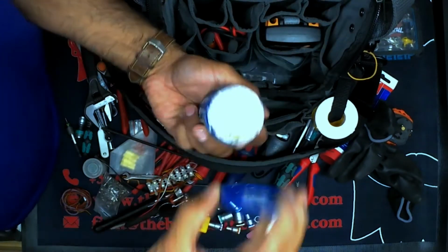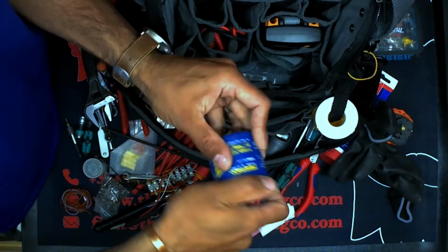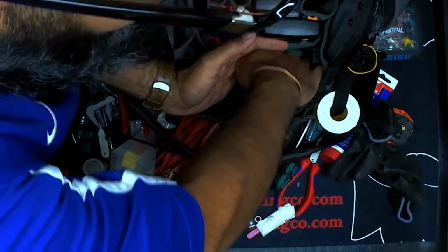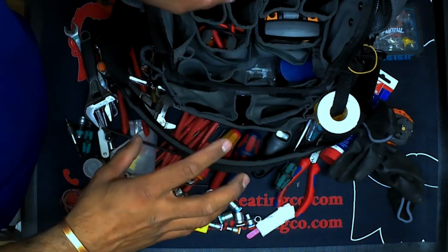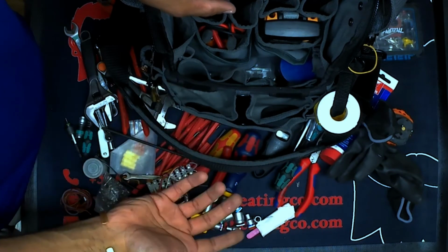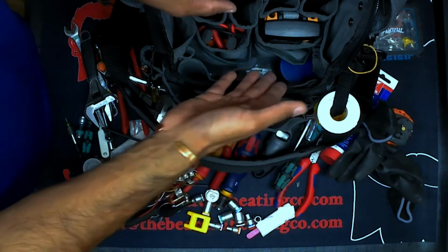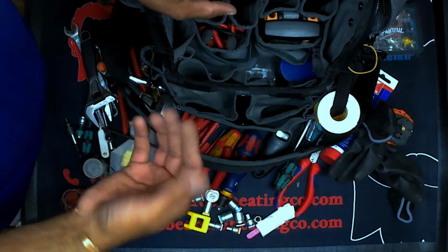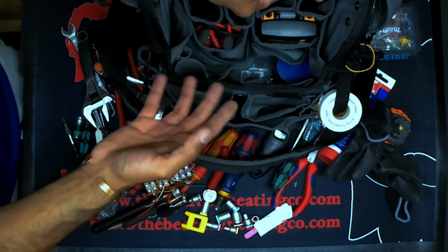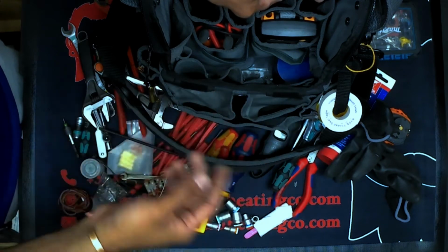And good old Waterhawk. I prefer Waterhawk over Hawk White. It's only for gas and heating water really, and not for potable water, whereas the Waterhawk can be used on potable water and gas and heating. So therefore, yeah, I keep this. One tub does it all for me.